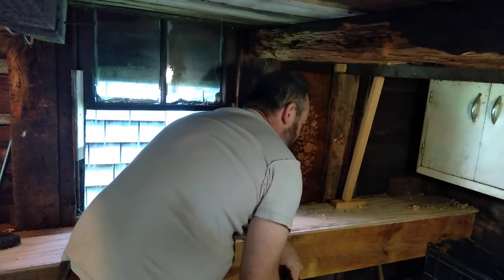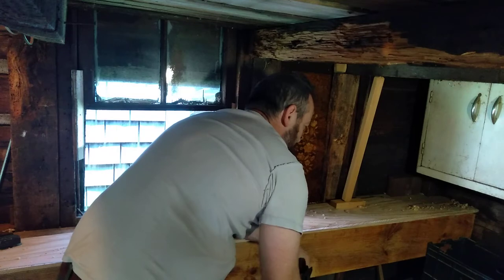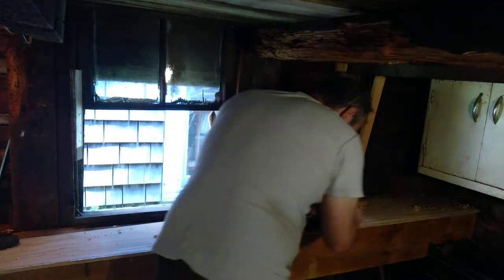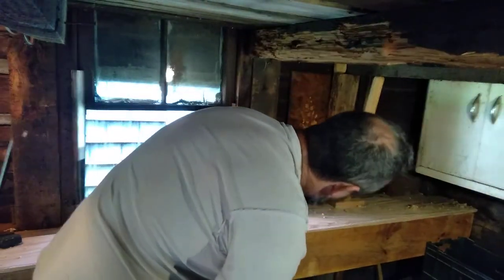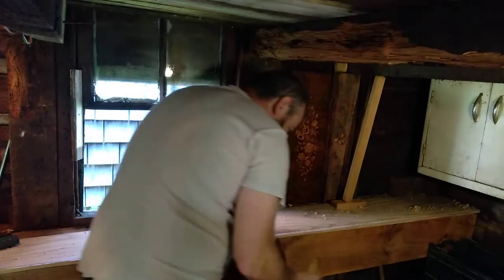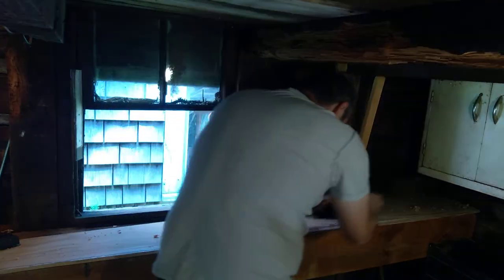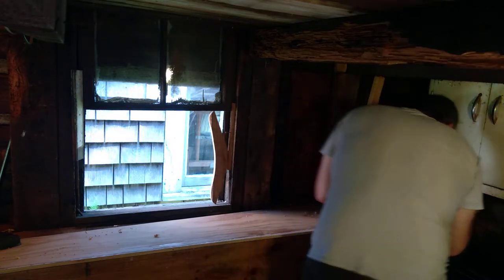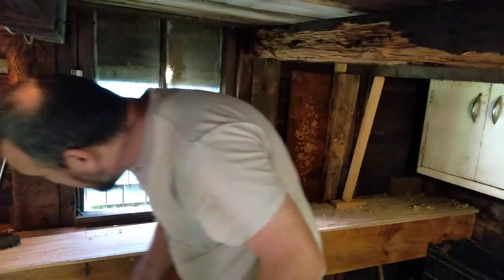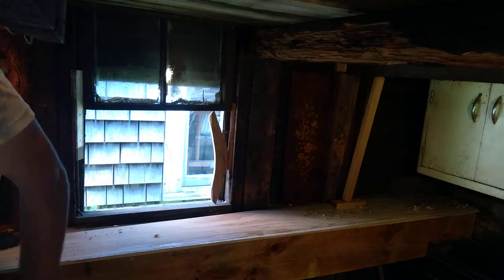And while the plywood isn't as easy to cut as the pine, the plywood is easier to see the shape of the bevel you've got, because each of those layers of ply kind of acts as a topographic line, to show you how deep you've gone. That's quite close, if it isn't a final bevel right to the end. But you can see there how I've tapered it off.